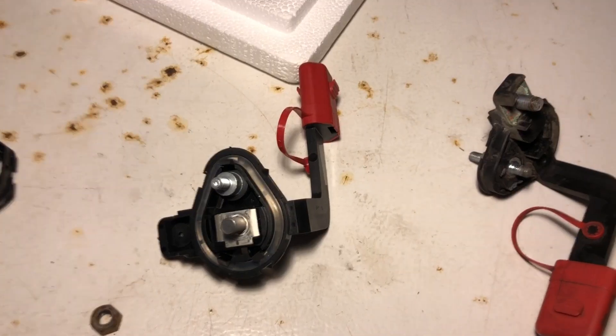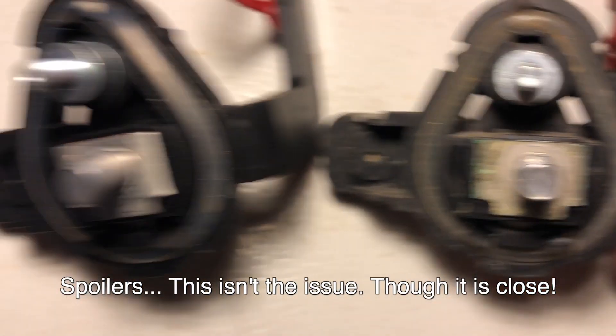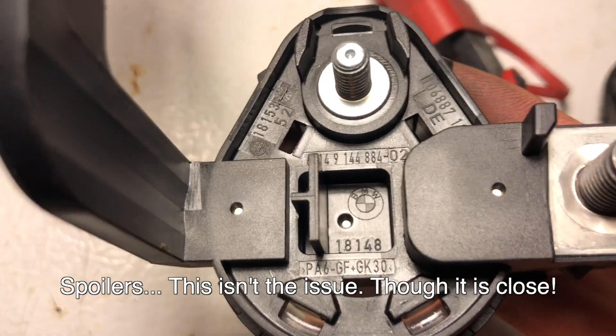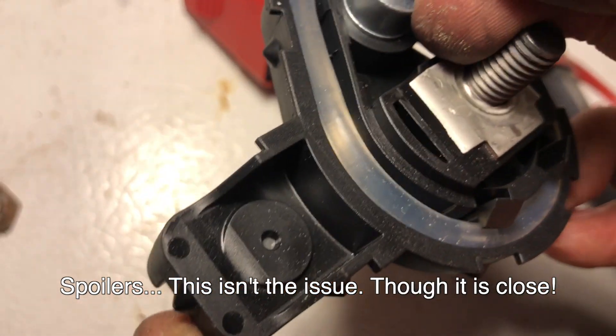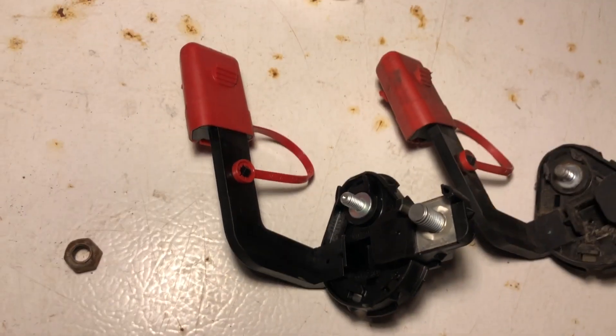On the back side of the terminal there's a back component, and if there's something in there that I shorted — oh, there's another wire. Here we've got the new unit and the old unit. It doesn't look as bad at first, but when you turn it over it shows some corrosion. There's got to be some kind of fuse component to this that I destroyed. Gonna swap those out, put it all back together and see.